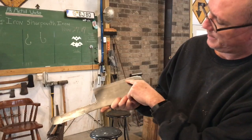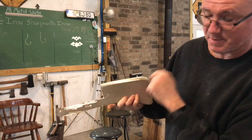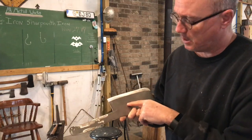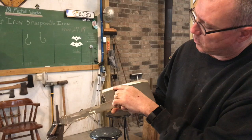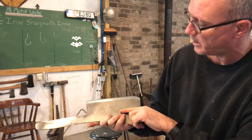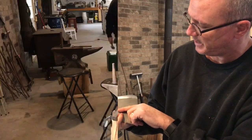I've got the first grind, and that's the wide grind that you see here. And then to try to make it a little bit of a convex edge, because he's gonna be chopping into bone with this, I don't want too thin of an edge. I wanna have some meat on there. And so I've ground in a second edge on top. I'll try to move that a little bit so you can catch both edges.